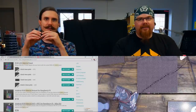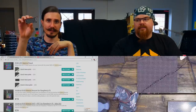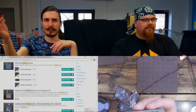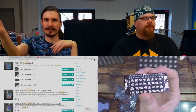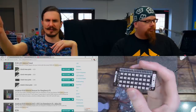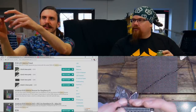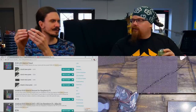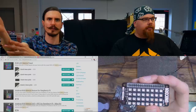So, obviously, on the very low end, we've got our own Unicorn pHAT. This, of course, is something many people will already be familiar with, that I can't position under the close-up camera because I'm totally out of practice. It's basically 4x8 RGB, WS2812Bs or something to that effect. They're little tiny pixels with a brain in each one. Or an analogue of that, which is the SK6812. It could well be SK6812s, actually, because they are allegedly more reliable.